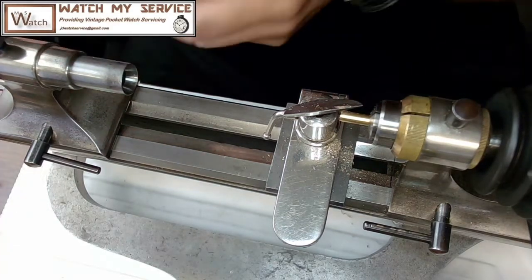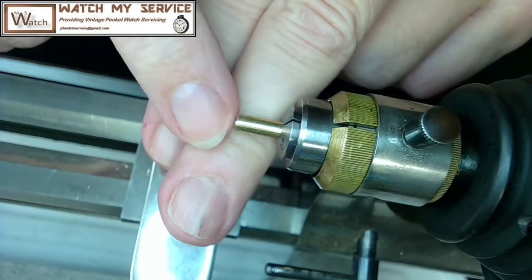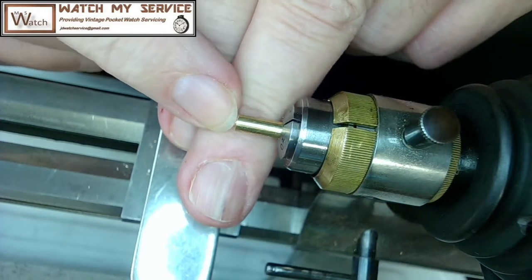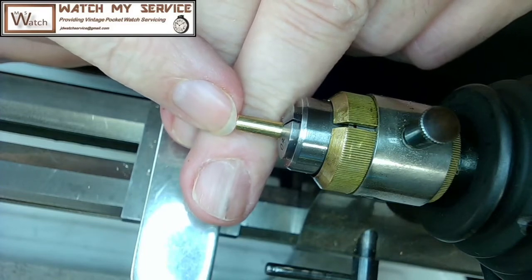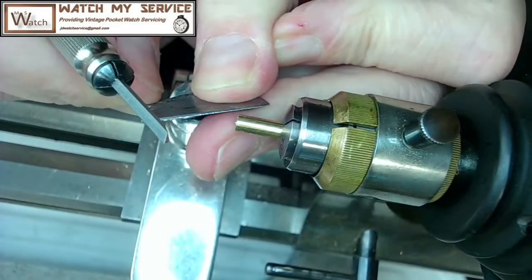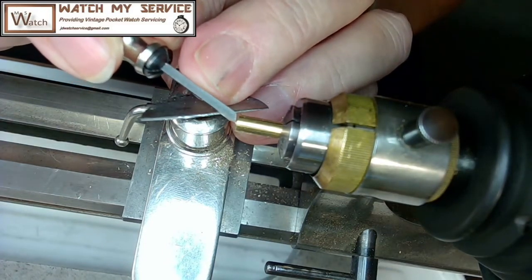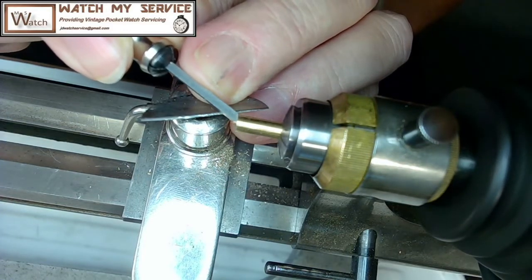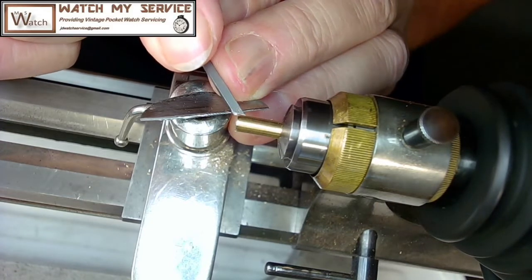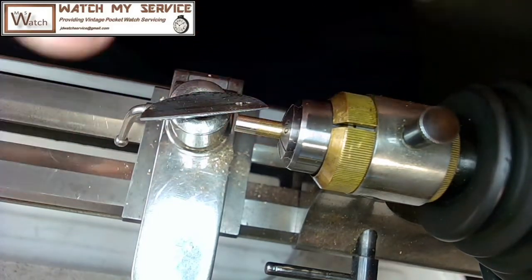You don't have to press too hard if the graver is sharp. I can feel almost no bump now — it's almost completely flat. Now I need to trim down the little knobby at the back. I adjust the camera so you can see better. There's a small knobby on the end — I lower the graver just a bit to get to it properly and chew it away. Then I use the other side of the graver to take a little material off the end. Now it's a nice, clean-looking piece.